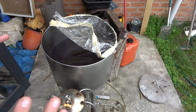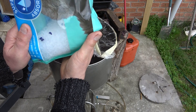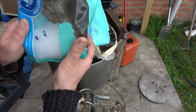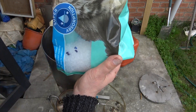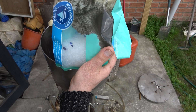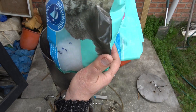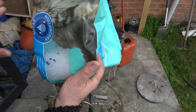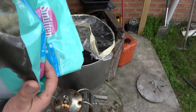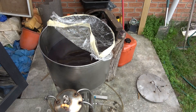You will also need some metal mesh at the bottom of your hopper, then a little bit of silica gel crystals — in this case it's cat litter. To treat 10 liters you would need approximately half a liter of silica gel. You put it in first. The main purpose of silica gel in this case is to protect the metal mesh so it won't get clogged.